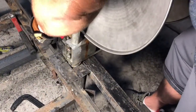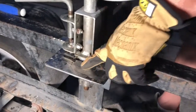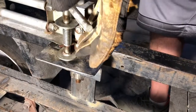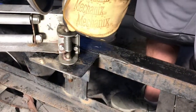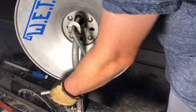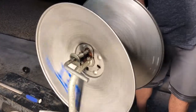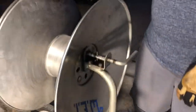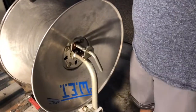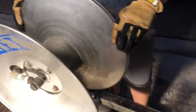What we have is a piece here that will turn and drop into a hole. I'll come back and drill some holes in this angle iron and have some different locking positions. Once there are holes in there, you pick up on this and turn it to the side where it doesn't touch, swivel it where you want it, pick it up, drop it into the hole, and click until the hole is done. This turns and locks, so now we can get our hose wound in. It's even got a feed guide down here below. Whenever it's time for travel, you just pull this and turn it and it drops into the hole as well. The two pieces can be locked right here, gun over here — you're ready for travel. Nothing's going anywhere. I've got two of these.